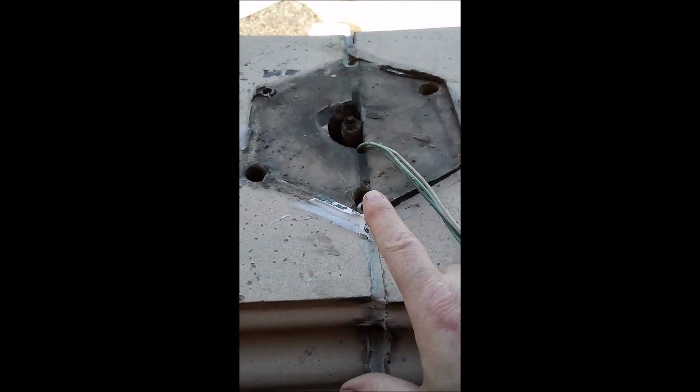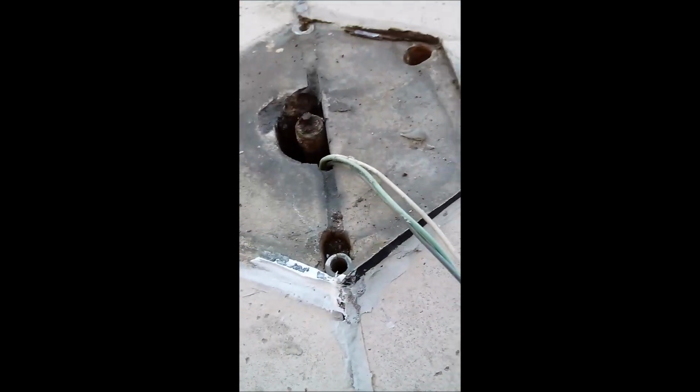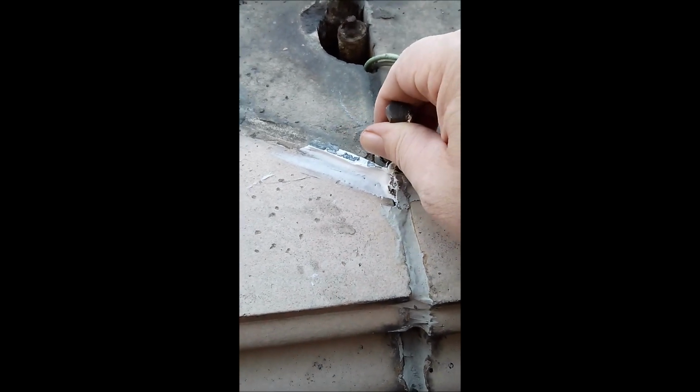All right, this is one of the mounting positions for one of the lamps. As you can see, there are lag bolts and lag bushings. Unfortunately, one of the bushings drops straight through, and this one is pretty much stripped out. So I'm going to have to replace this one and get one for here and just absolutely fill this up with JB Weld while I hold the bushing in place. As you see there, I'll put the lag bolt in the bushing, put it in place, and then surround it and pack all JB Weld in here to hold that lag bushing in place. Either that or this lamp will not be secure, and in high winds it'll come tumbling down, and we don't want that.